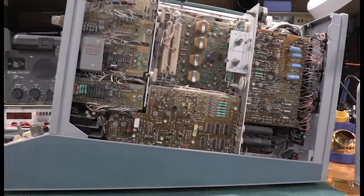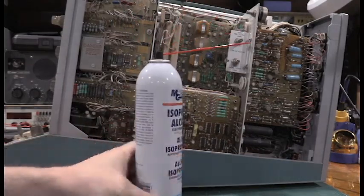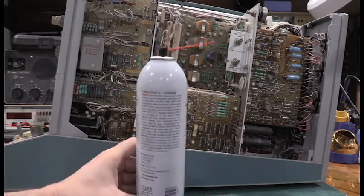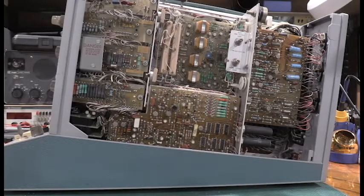I had to replace one of the gear reductions on one of the 10-turn pots. The way I clean the switches is with isopropyl alcohol. MG has aerosolized 99.9% isopropyl alcohol — this video is not sponsored by MG, I just found this recently. I like the pressure that comes out; when you spray it's got a decent amount of pressure behind it so you can actually get it into switches and get them cleaned up. I'll probably buy at least a couple more cans. While I'm waiting for the alcohol to flash off from the switches I've sprayed this morning, I'll turn the unit and talk about what I ran into on the front controls.